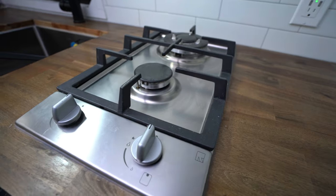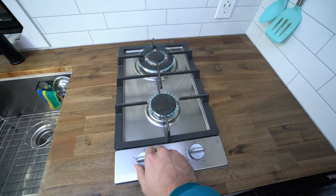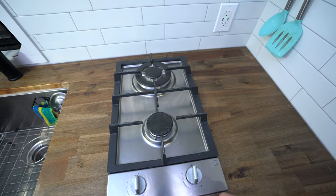When it comes to installing a stovetop, you want to make sure that the propane tank is as close as possible to the cooktop so you don't have to run a long length of hose. If you're always shutting your propane off after using your stove, it does tend to dissipate over time, and every time you want to use the stove again you turn on the propane tank and it takes a little while for the gas to circulate through the hose to the stove.